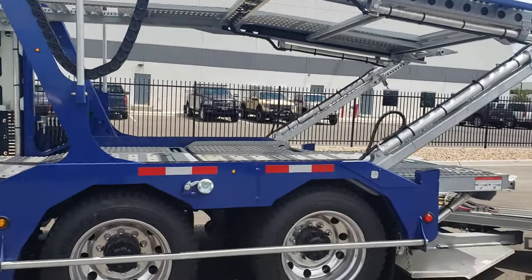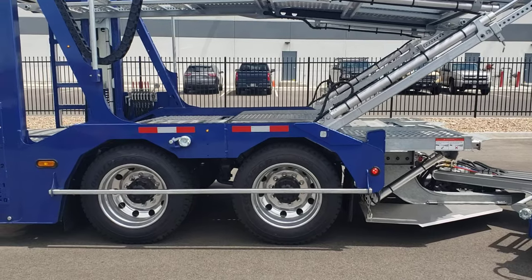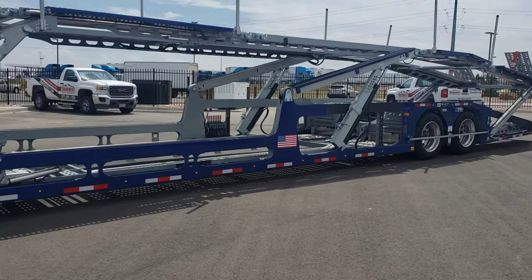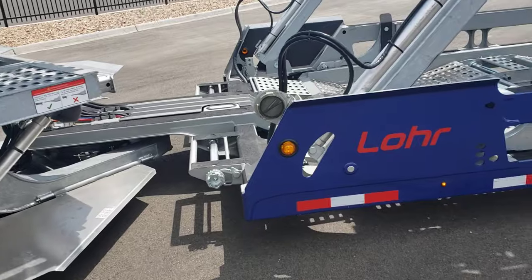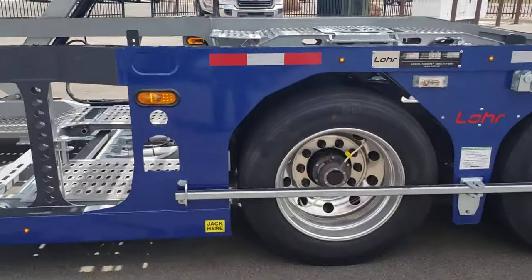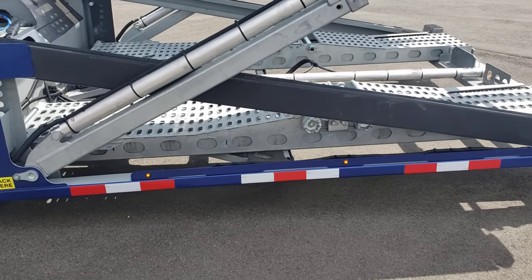So it's efficient. Its length is basically equivalent to a longer wheelbase, so there's more after-frame — as you can see, about a foot of extra after-frame. The trailer itself is going to be 300 inches from the front of the wheel well to the very front of the trailer at the spinners of the ratchet, and then you will have 220 inches from the yellow sign that says 'jack here' all the way to the back of the trailer. The number nine deck is 120 inches long.